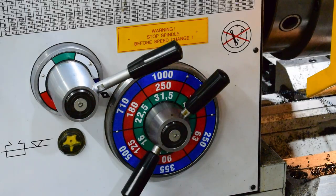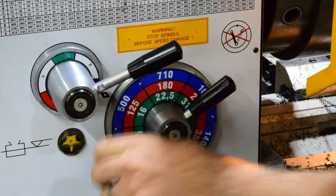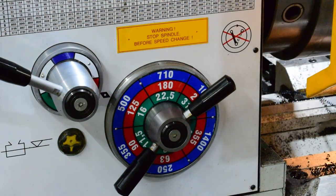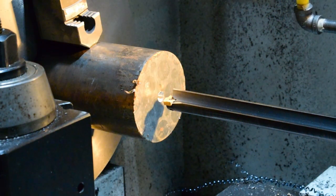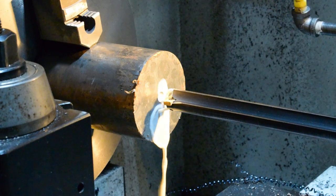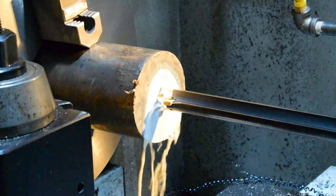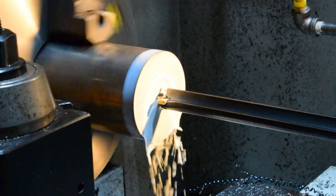The manual says to use a shorter drill to start with, but I was being cheap and I'm not looking for a perfect bore as far as where it comes out. We're going to start out slower — I'm going to start at 125 RPM for the first pass until the drill gets started, and then we'll go ahead and speed it up. I'll turn the coolant pump on and get that coolant coming through, and start with a little bit right away to just get moving so I don't make a huge mess.